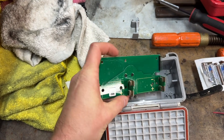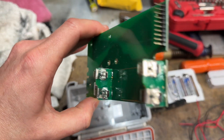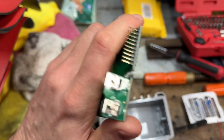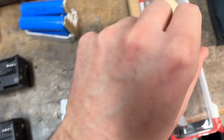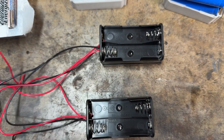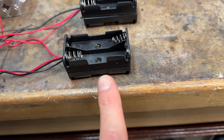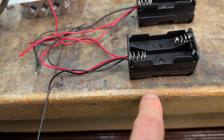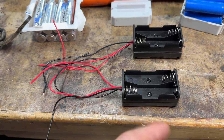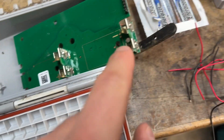I removed the board - it's just some T8 torx screws - so I can access the solder joints already on here. We'll just solder them right to there. I got some quick 5-minute epoxy and we'll epoxy these together to make a series-parallel pack. You can't use one of the 4-pack holders because the 4-packs are 6-volt. You've got to set it up in pairs - series-parallel - because we want 3 volts and 3 volts for the capacity. So two reds from here go there and two blacks from here go there, and the same thing for the second pack.